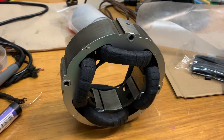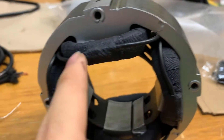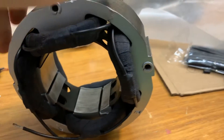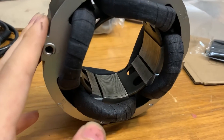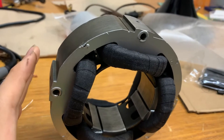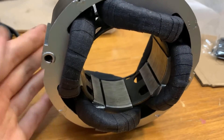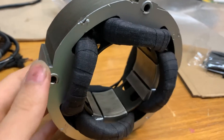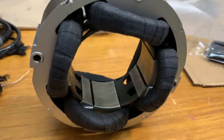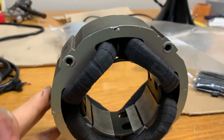Here is the newly rewound stator, now all complete. I've made all the electrical connections — they're tucked in here to join the poles, and these two are just the leads for the head wire, which will be fed through this gap, exit through the front motor housing, and into the base where the speed coil is. It's a success — I'm very happy with how this turned out. These coils were 100% wound by me without any fancy tools, and it's probably one of the proudest projects I've ever worked on. I haven't tested it yet but I'm guessing it works.